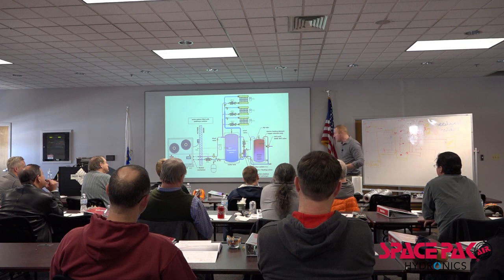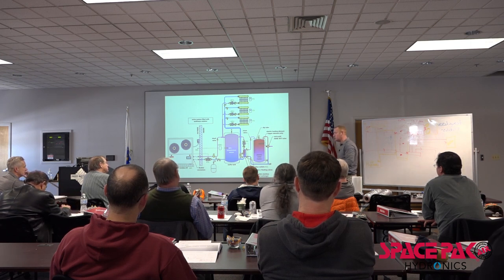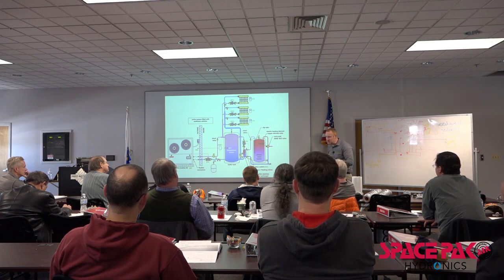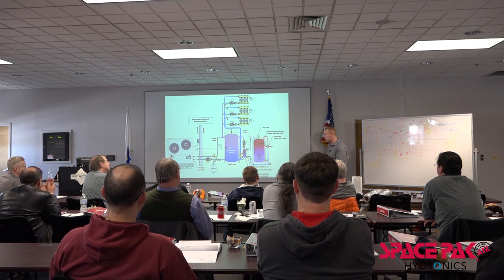However, you have to be sure that there's enough flow and we can pick up enough capacity to handle whatever load is on the load side. Generally speaking, most of those I've seen are much smaller. Maybe 1.25 inches is the biggest one I've ever seen, with that coil going inside and the tappings on the outside. If it was a small load situation, I don't think it would be a problem. If it was a big load situation, we would run into the same thing on the opposite side, where our heat pump would pump that tank up to 125 degrees, no problem, but we can't extract that heat enough because there's not a big enough differential in the temperature. If we're looking to deliver 120, and that tank's sitting at 130, we're only going to pick up a certain amount of degrees in that water by the time it gets out.